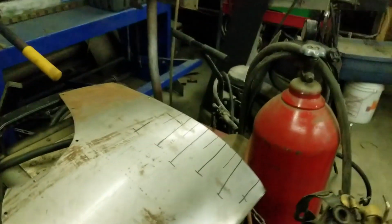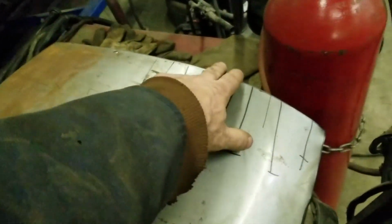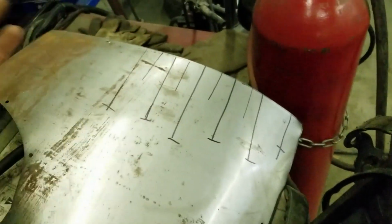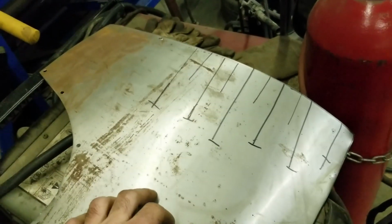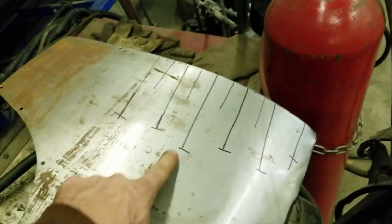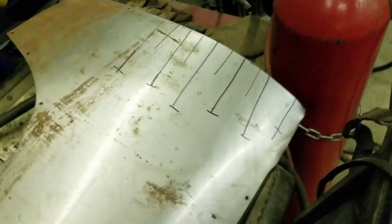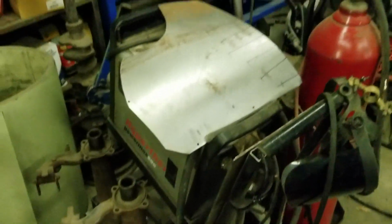and smooth it out. So the idea here is I made the pattern. It's kind of how deep I'm going to go to shrink. You could do this all just with a hammer normally, but with the machine it's a lot faster. Mine leaves a crazy amount of tooling marks, but I'm okay with it because it's what I got and it beats any other alternative I have.